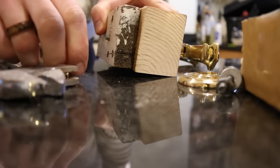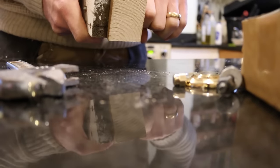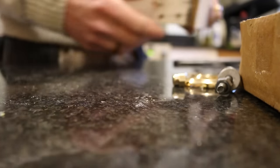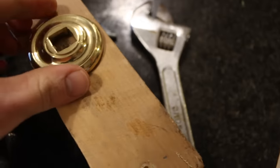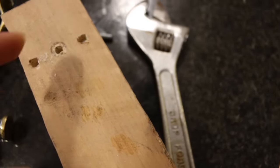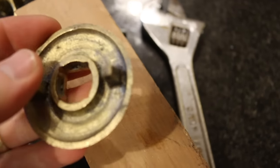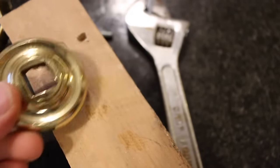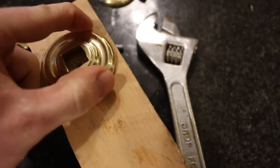There's no fixed height for these things to go, but traditionally I think they're about a third of the way down the top panel — we've got a four-panel door. This mock-up was also to check the size of the hole needed for the two pegs — basically two studs on the back of the plate which stop it from turning. I wanted to make sure I've got a really nice fit; they turned out to be 7mm holes.